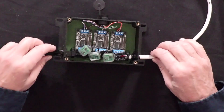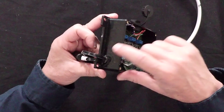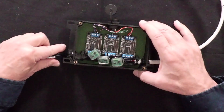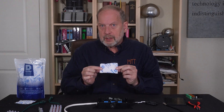This box is made out of ABS. One of the things that's nice about ABS is that after I went ahead and put in the wiring, I was able to take some small pieces of ABS and with regular ABS cement, cement those in there, so it's pretty tight. Now there is a possibility a few drops of moisture could get in there, so before I seal it up I'll put a couple of these desiccant packs in, and that should take care of any water that creeps in.